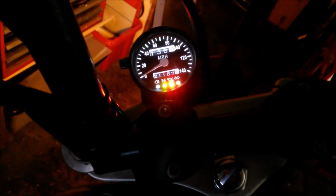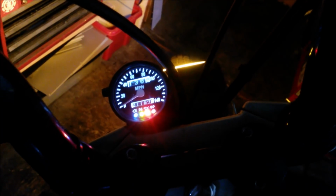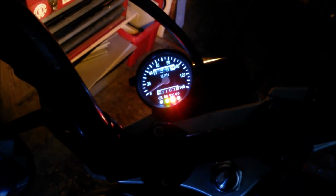Okay, I've tried to make the shed quite dark. I've stuck the speedo on. I was wondering, maybe should I have gone for like a 130, 150 ohm? Maybe the 300 was a bit excessive. It is pretty faint, but I think it's going to be fine for me anyway. Other people might prefer a slightly lower value resistor. So this is in the dark. And it's actually not coming through; it's interesting, looking through the camera, it's more apparent in the flesh that that blue light is on than it is through the camera really. But yeah, maybe a little bit of a lower one, but that's not going to bother me.